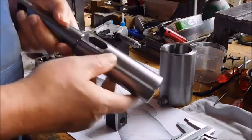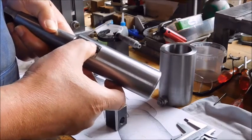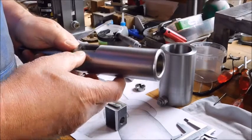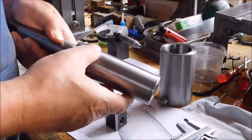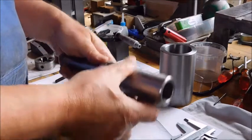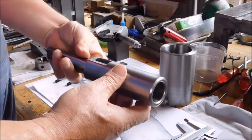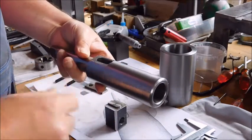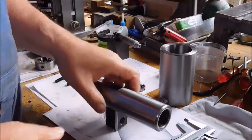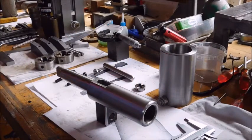But there is something wrong. When I milled this down, I wondered why there was difference here, and I explained it with some twisting of this hole, but there is something wrong, and I'll do it by placing this in the vise on a parallel, and then take to flatten this again, and this time it should be right. Yeah, I think that's a plan for now.